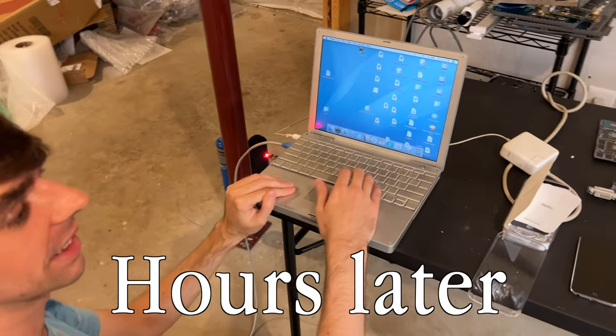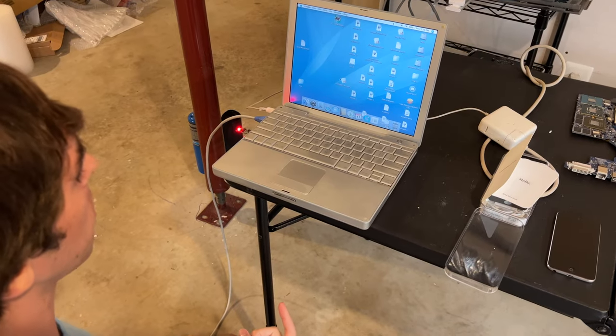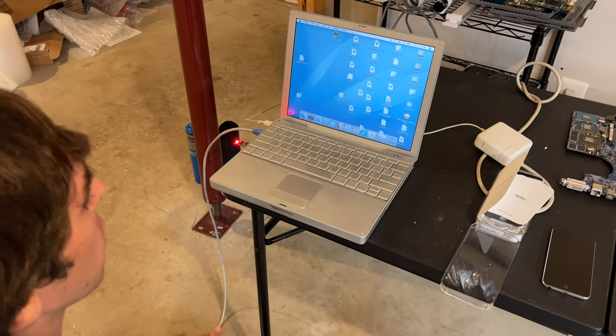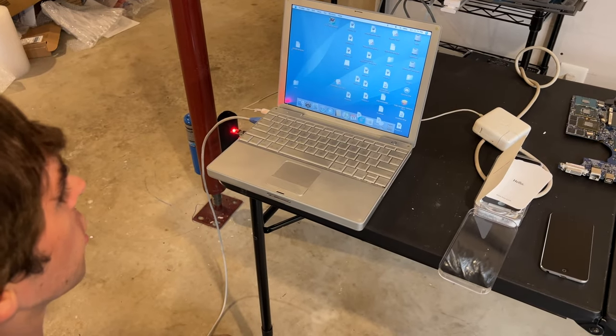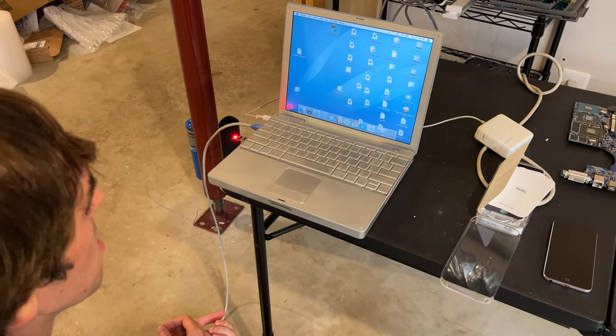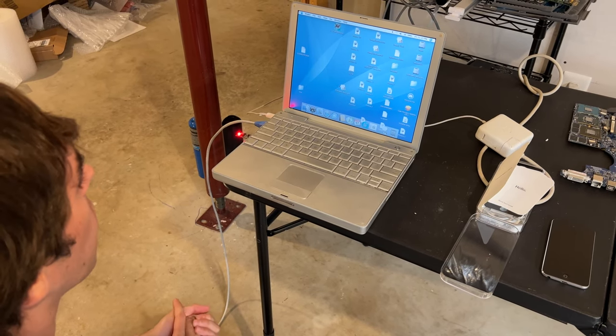All right, Collin, so what happened so far? So we tried the original Mac ROM from the legitimate GeForce 4 Ti4600. It did not boot with that, or at least it didn't show video. We tried the modified Mac ROM for the Ti4600. That also did not work.